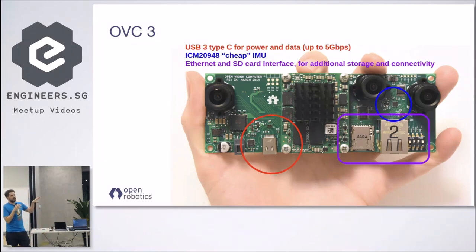We included a cheaper IMU — previously we used a VectorNav IMU in the order of thousands of dollars, so now we have a basic version with cheaper sensors and allow everyone to expand by including additional sensors if they want, without forcing them to. There's also a USB Type-C connector for both power and data. For additional connectivity, you can have Ethernet or an SD card if you need more than 8 gigabytes of storage.